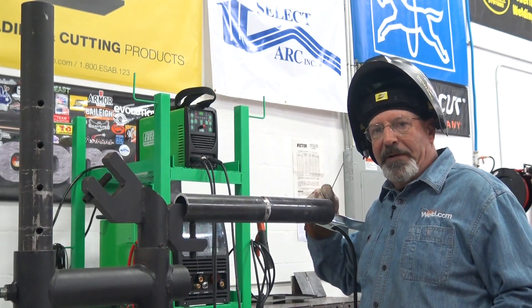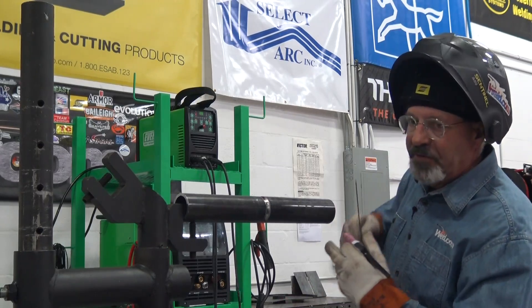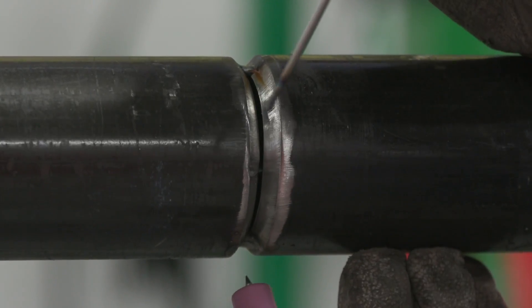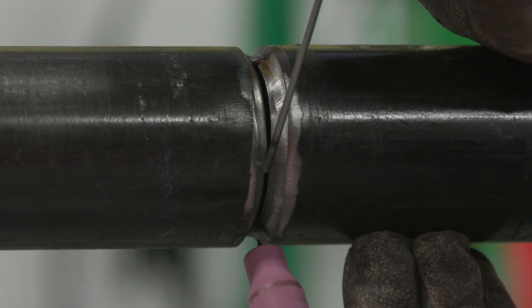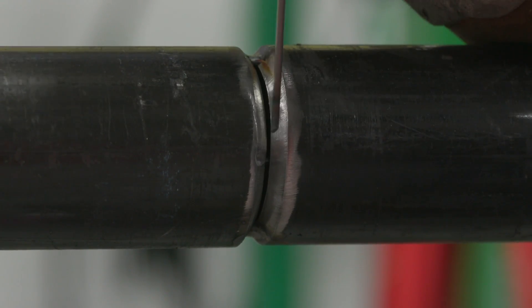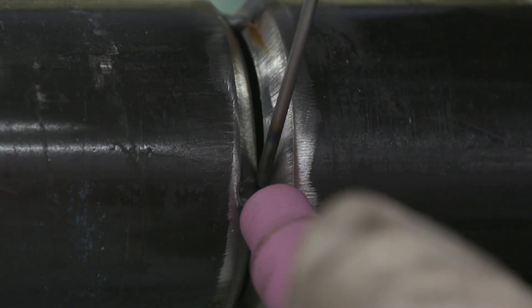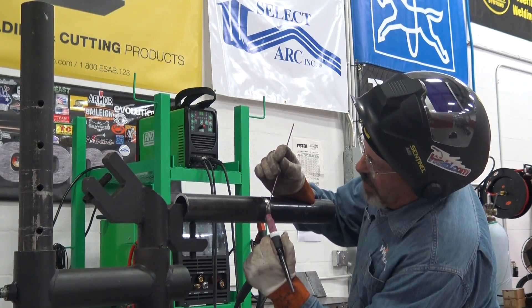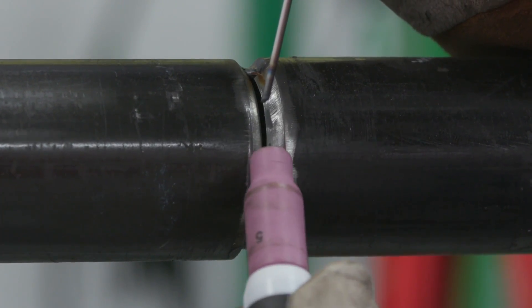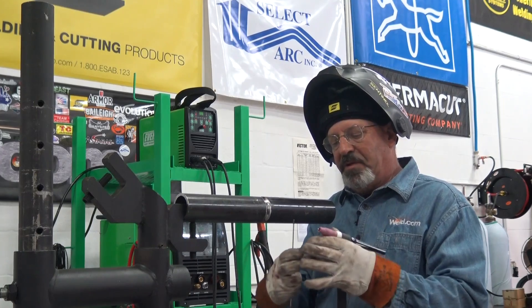My attempt — notice I hooked my ground up here. I'll take the ground off for a second so I can explain this. I wanna come in here and get comfortable, and I'm gonna put two fingers against the pipe. When I strike an arc, I'm gonna pause and get the puddle going a little bit. Put the wire on the leading edge. Since it's a 1/16 gap or smaller than the wire, I can kinda rest it on the leading edge here at the right angle, and I'm gonna come up to probably about three o'clock. At that point I'll probably stop, adjust, and rest the cup in here and wiggle it the rest of the way till I get up here on top and make this tie-in on my tack. I'm using two tacks today — one at the top, one at the bottom. They're half-inch long tacks, so things shouldn't move around.